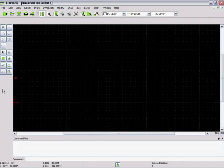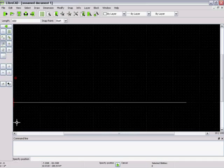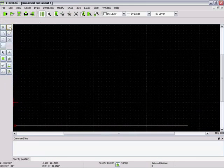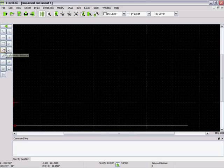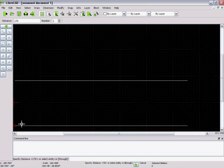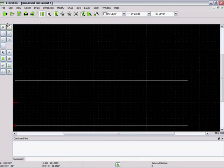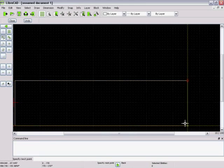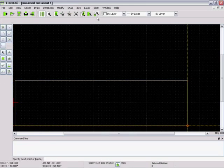So we're going to start the process of designing our fan box now. Look at 650mm wide by about 170mm tall, so just draw a 650mm long wide line and then put a line parallel to 170mm out. We'll join up the box, just like so. I'm using LibreCAD here, which is my 2D CAD program of choice.